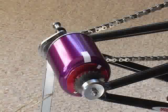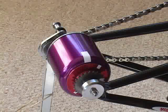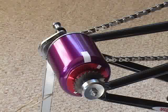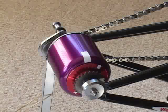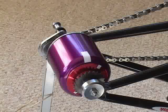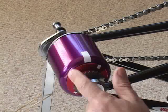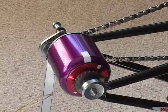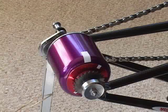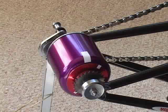We want to develop the SIVAT for energy-saving systems such as hybrid vehicles and kinetic energy recovery systems using flywheels. This transmission is scalable and configurable. One configuration, for example, would replace the sprocket input and output with a shaft drive input and output, which I've already designed. This transmission can be adapted for all kinds of uses.